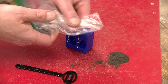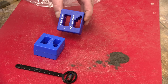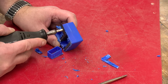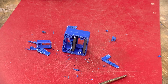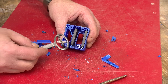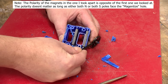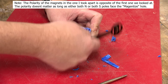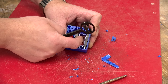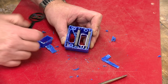So that's how this magical device works, but what we really should do is take the second one I bought apart and just confirm the magnets inside. And there we go — those are the two magnets. We can look at them using the magnetic field detector: the north pole of the sensor is pointing to the outside of one magnet, the south pole is pointing to the inside of that magnet and also to the inside of the other magnet, and the north pole is pointing to the demagnetizer side of that magnet.